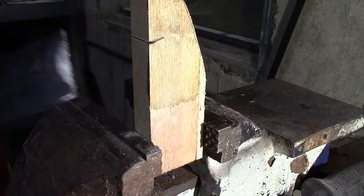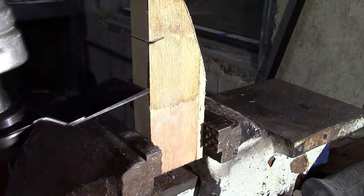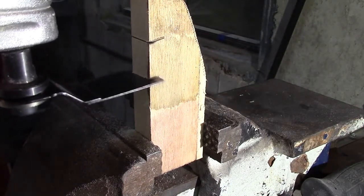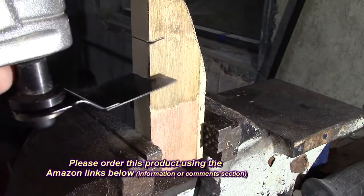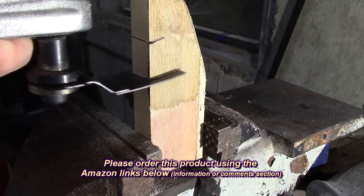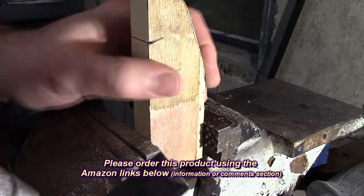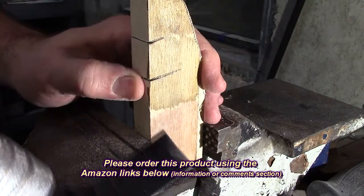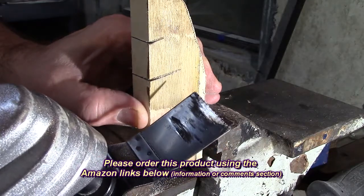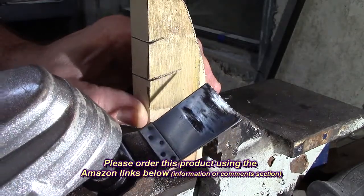There's the original cut, and here's the blade I just sharpened — the same dull one. You can see that was an improvement: it wasn't getting hot and it's a much straighter cut. You're not going to get new-blade performance out of it, but when you've dulled a blade on a job site or at home, this is a quick way to get more use out of your blade. And you can do this many, many times.